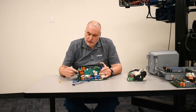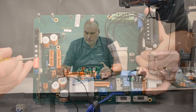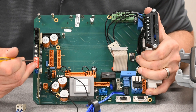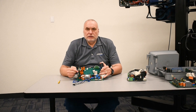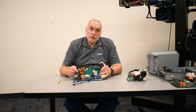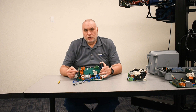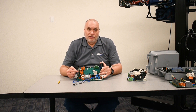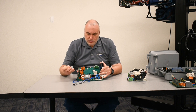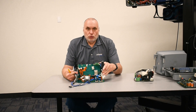One additional mention about the red DIP switches is switch number 6. If I'm starting up a crane and conducting a rated load test, turning switch 6 on gives me 15 minutes of lifting capacity up to 146% of the rated load. That allows me to conduct my rated load test. If the rated load test takes longer than 15 minutes, you might have to cycle this switch multiple times, but if you forget to turn it back, it times out after 15 minutes.